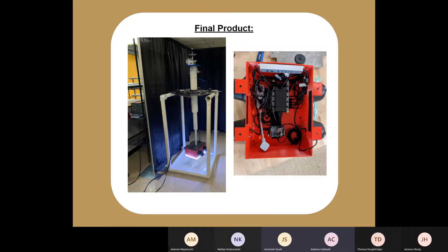The image on the left shows the final prototype. You can see all three levels of actuation as well as the illuminated camera housing at the bottom. On the outside of the camera housing you can see the four Amcrest cameras. On the inside, in the middle, you can see the PoE switch and its power adapter. At the top is the power adapter for the LEDs, on the left is the surge protector, and on the bottom is the Arduino Uno with a solderable breadboard housing the sensor circuit.